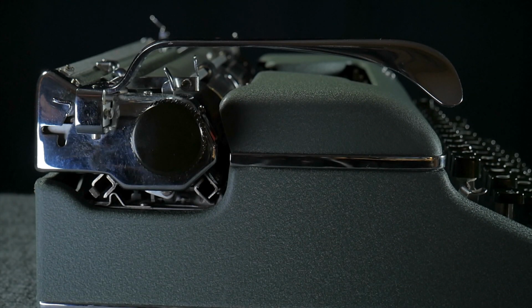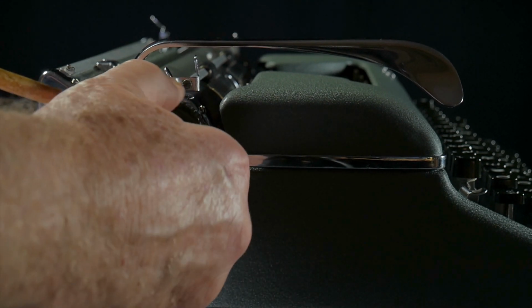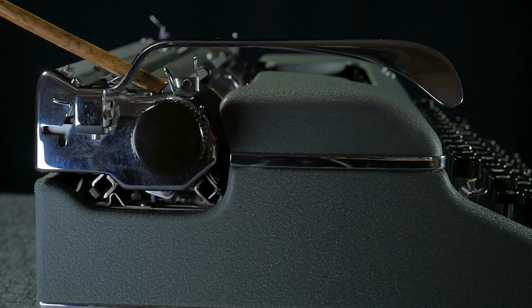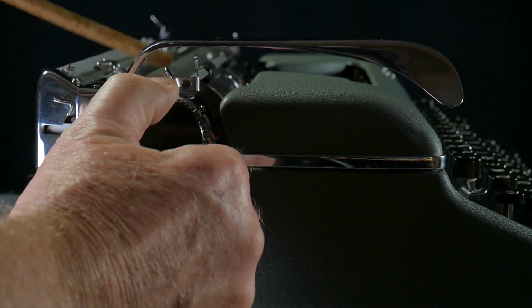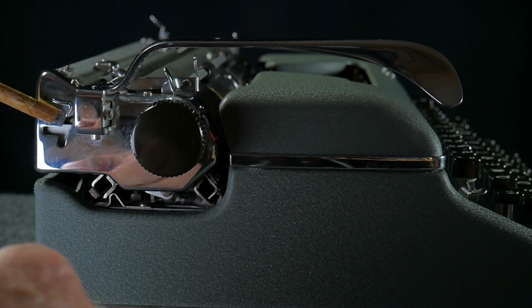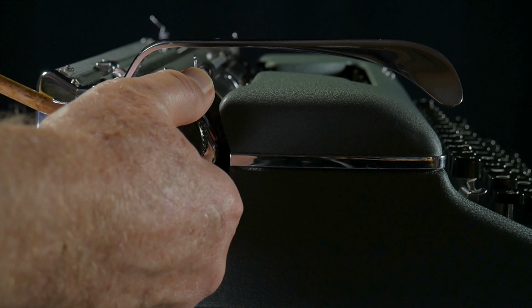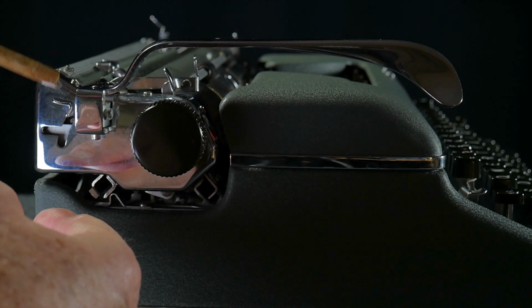Look at the left side of the carriage. Well, you have your left carriage knob, and of course it clicks like that. And you have your carriage return line advance lever right here. And then right inboard of the left carriage knob is your line selector, and it goes between 1, 1.5, and 2 lines. And so that amounts to 1 click is a half a line. And then this lever right here will temporarily disengage the ratcheting for the line spacing, but if you flip it back, you'll restore the original line spacing. So that's the temporary line spacing disconnect right there.